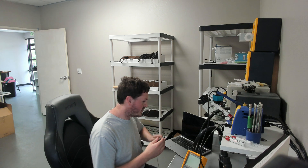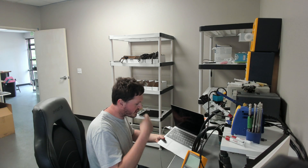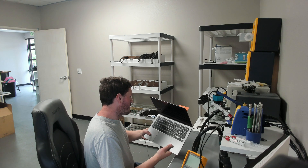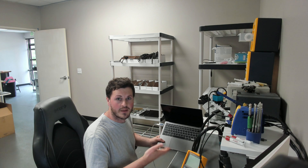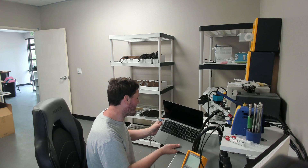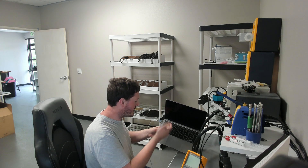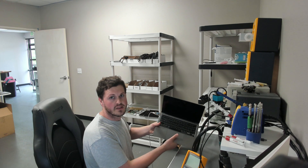This is going to tell us what the board is taking as far as voltage and amperage goes. On one port here, I have 5 volts and 80 milliamps. So that is very low — it is not really getting much into the power sequence at all. I do have a USB power delivery 2.0 fixed, 5 volts at 3 amps.